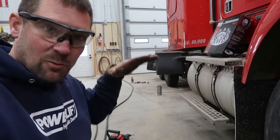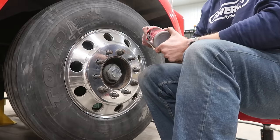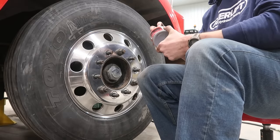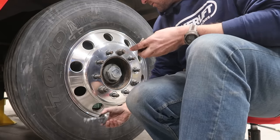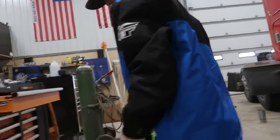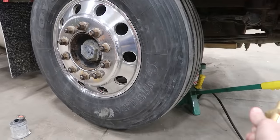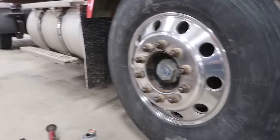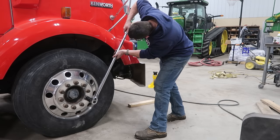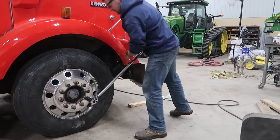Because if you're way off, your front end's going to ride like this and then damage happens. This is the first one. How long have you been on it? Not long, but I had an agronomist out here for an hour and a phone call that took 40 minutes - this didn't take me too long. Wheel one is snugged up. I still got to torque that and then put the cap on and check tire pressure.